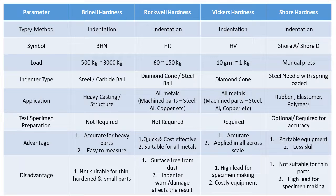This comparison is majorly done between four different hardness numbers: first is Brinell, second is Rockwell, third is Vickers hardness, and the final one is Shore hardness. We will go through each and every parameter to understand the uniqueness of each hardness. All four hardness tests come under the indentation test method, which is widely used in the automobile and mechanical engineering field.